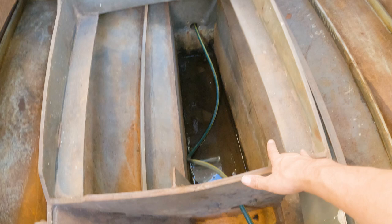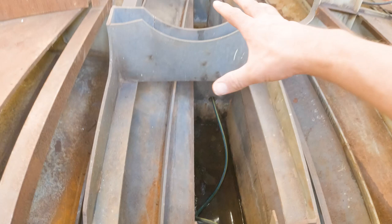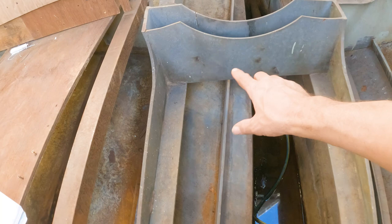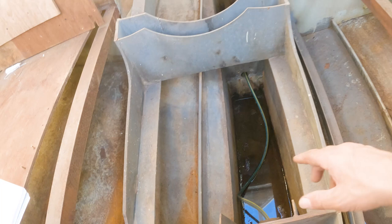and this is already quite well welded in and it's really well built. So I could make a plate up here which bolts down onto this little area that's already been made, and the electric motors just sit and bolt down onto here, obviously with some resilient mounts to take out vibration. But that could be a good little setup to mount the electric motors in, but we might not have room for two big electric motors side by side, so we may have to put one in front of the other and have both belts going down on separate pulleys to the prop shaft.